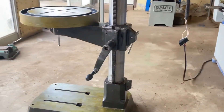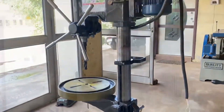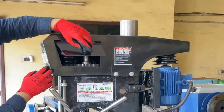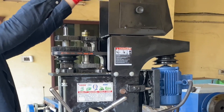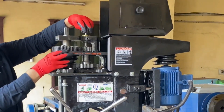Diameter of the pillar is 88mm. There are a total of 6 spindle speeds that range from 65rpm to 2200rpm. This machine is equipped with a number of lubricating points to ensure long life.